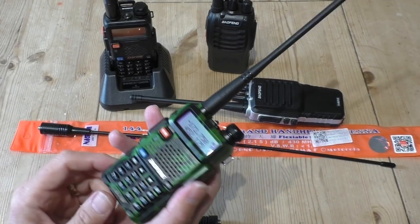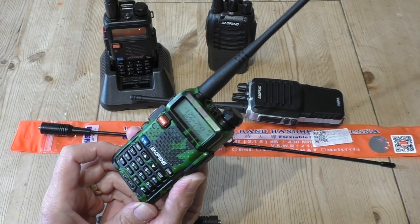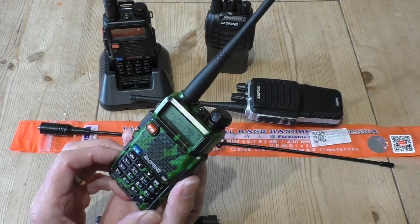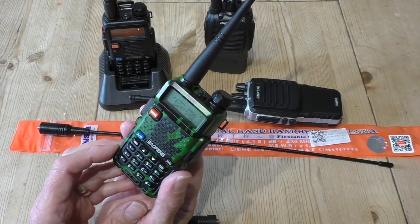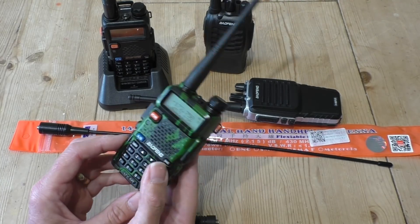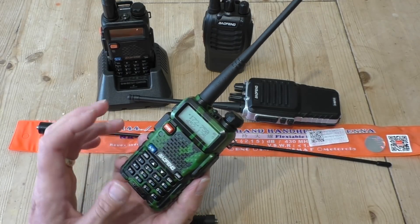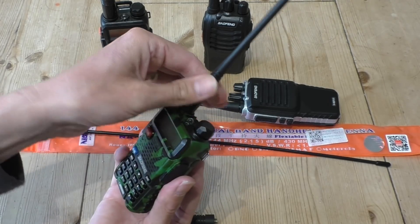That is a conscious decision you have to make if you decide to import one of these radios and use it here in the UK. The first thing you really must not do is, as soon as you get the radio out of the box, start transmitting on the frequencies already programmed into it. These radios seem to arrive in the UK with a variety of different frequencies, some of which may interfere with emergency services. If you're close to a hospital or fire station, you might be picked up by their radios and you could be tracked down and prosecuted. So you have to reprogram this radio pretty much as soon as you get it. You can do this using the keypad on the radio, or if you have the PC connection cable you can use a free program such as CHIRP — just Google it — and you can program these radios very quickly to the eight or 16 legal PMR channels.